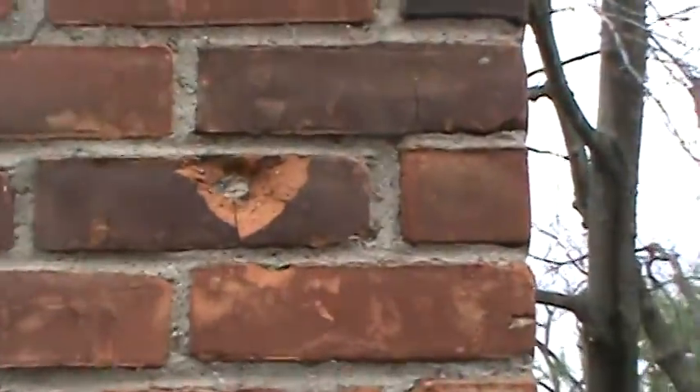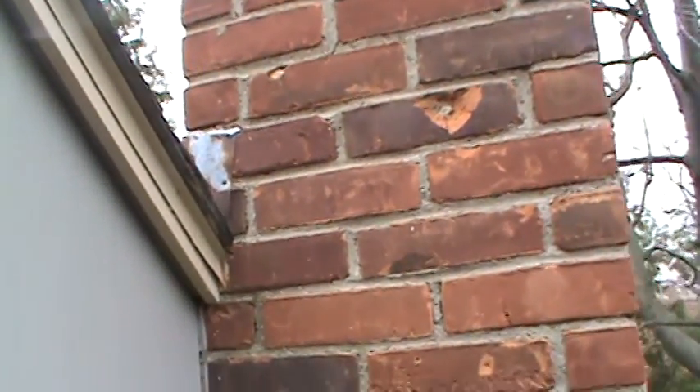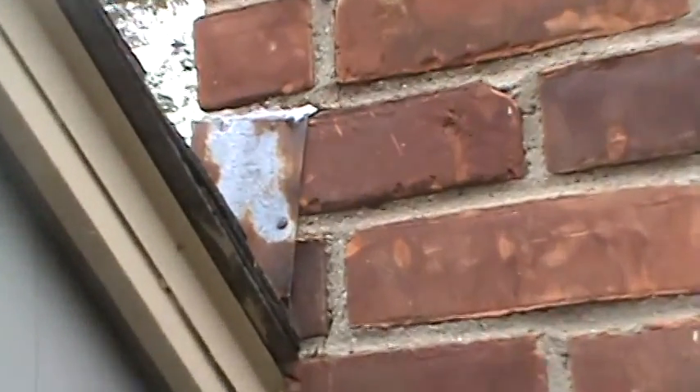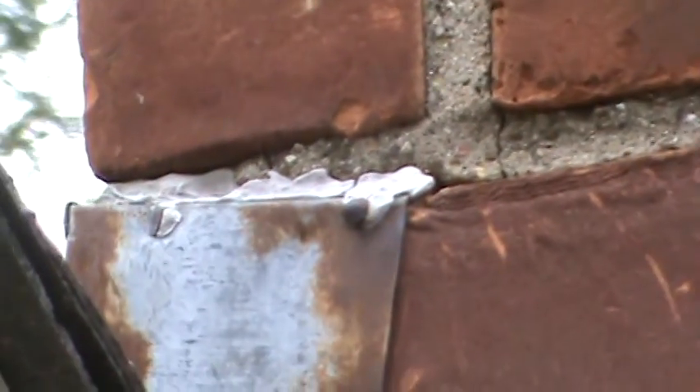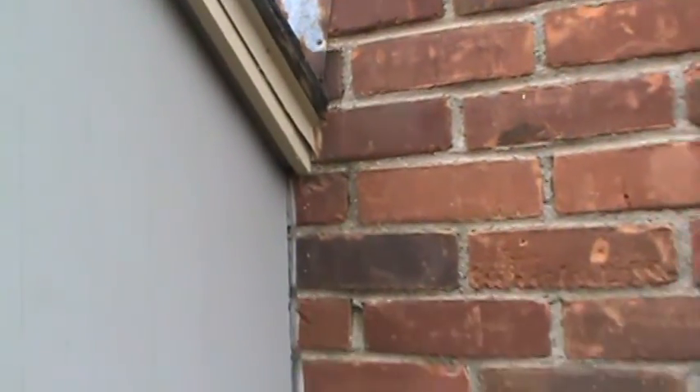There's a little pock hole here — that's not the end of the world, some sort of brick malfunction. The flashings aren't sealed anymore; it's very old caulk, about 25–30 years old, old and falling out, getting crumbly. The flashings are rusting — that's the metal here — and on the top flashing right down here it should be caulked in this joint. This shouldn't be left open; bugs and things are crawling in. The caulk is really old right here.